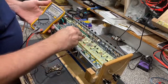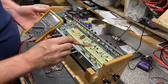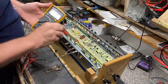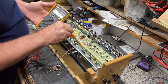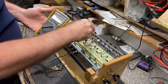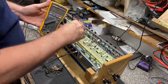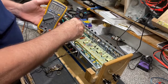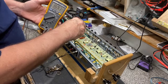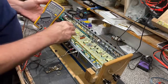Moving over — some hot spots in this amp to be careful of. This red wire coming in here goes to your reverb transformer, and that's going to be full B+ voltage — 445 volts. Another spot feeds directly off the filter caps into the tremolo, and you can see the reading moving around because of the circuit — about 415 volts on that one. All looking good as we move toward the power section.